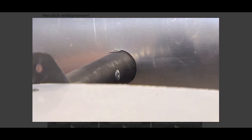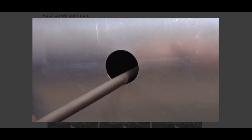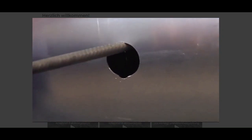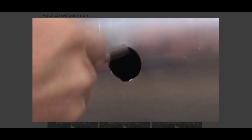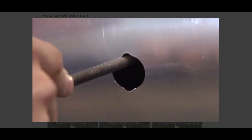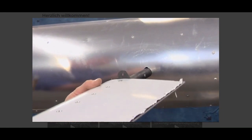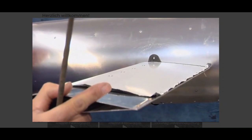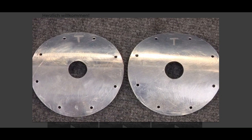Note, you'll need to notch the pilot side hole to allow for the rivets to pass through. Make 2 4-inch diameter doublers from 25 thousandths aluminum and drill a matching 7/8 inch hole in the center of each. You can cut the material from the roll of 25 thousandths sheet stock that was included with the tail boom. Drill 6 to 8 holes at equal distance in the 4-inch doublers.